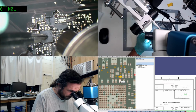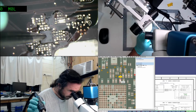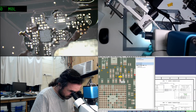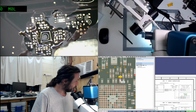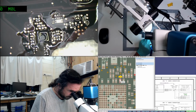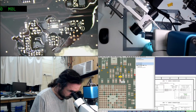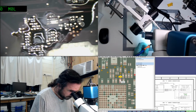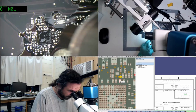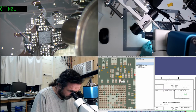Farnell, at least we actually managed to replace the big MOSFET without destroying the connector. I'm pretty happy with that. Okay, I'm going to have to clean this up and reflow it, because it's skew and everything. It's had too much solder around the base on that ground pad. We'll just hit that with some more hot air and give it a little tap with a hammer to the head. Yep, knew that was going to happen.